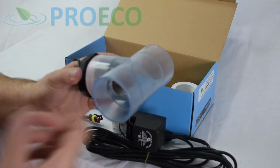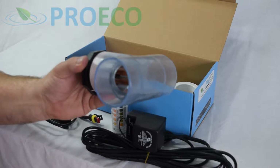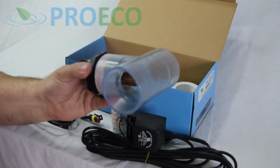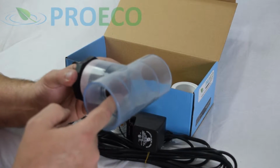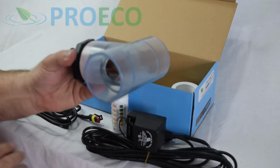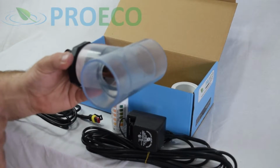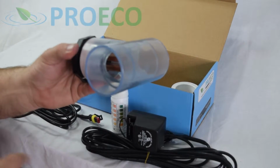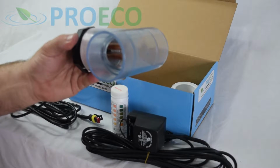Also, if they're corroded up and covered by algae, that's really bad. What can happen is algae, if it's going past there in big chunks, can begin to build up, and it will actually bridge the anodes, and if that gets bridged, it can actually short out the power. So you just got to pull this out, clean it, turn around, put it back in, power it back up, and usually you're good to go and you haven't damaged anything.